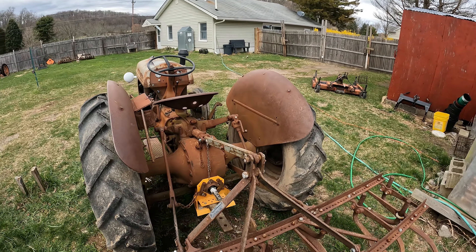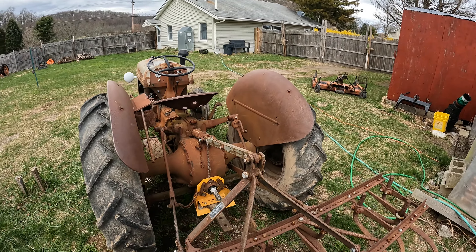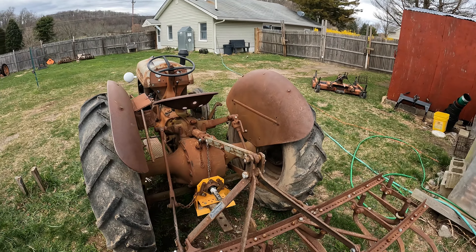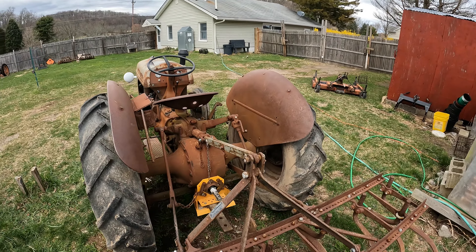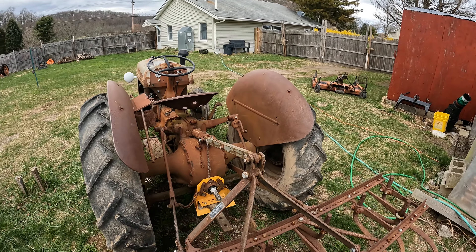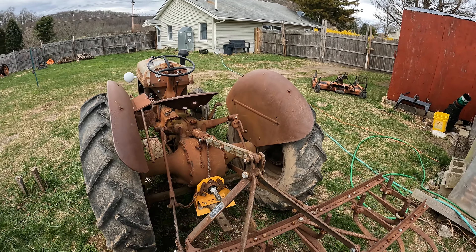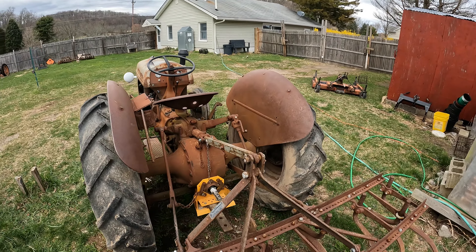Notice how I'm getting on this tractor — I don't have much leg room. I'm six foot four with long legs, so that's something to consider. Manual steering is on the 8N, 9N, and 2N. And when you're pressing your clutch in, you have to turn on your PTO to make the three-point hitch raise — it will not raise otherwise. So if you're going to be driving with a brush hog on there, it's not going to lift until you turn on the PTO lever.